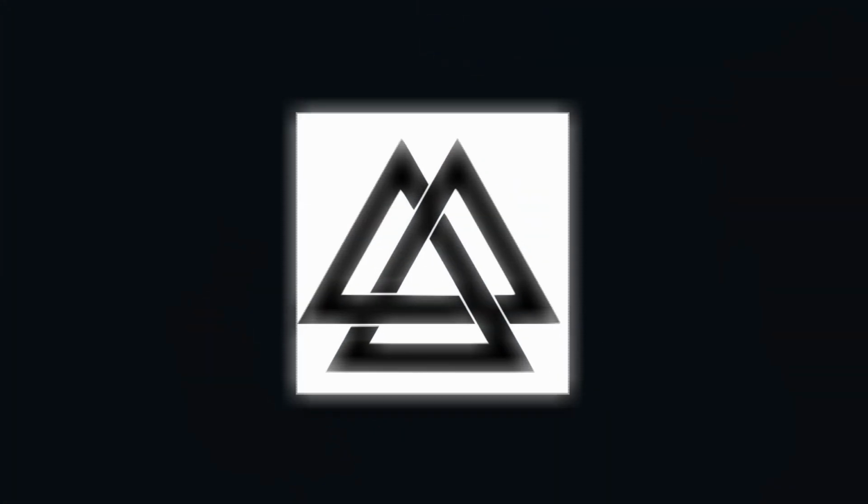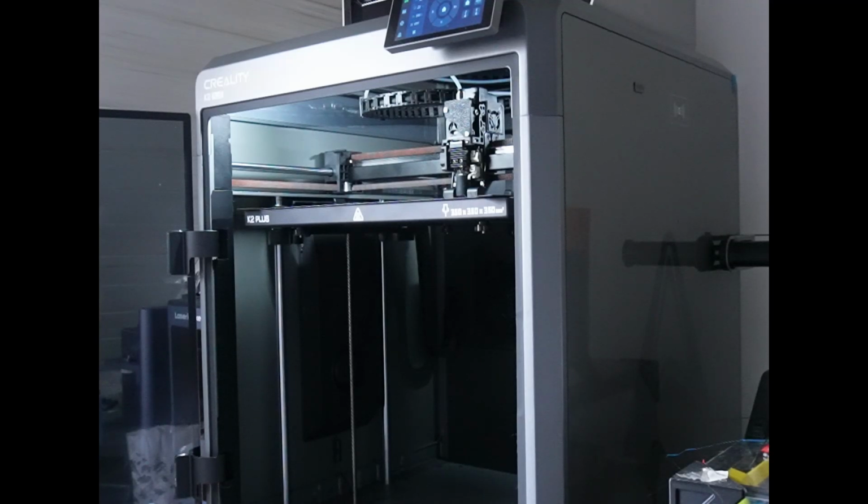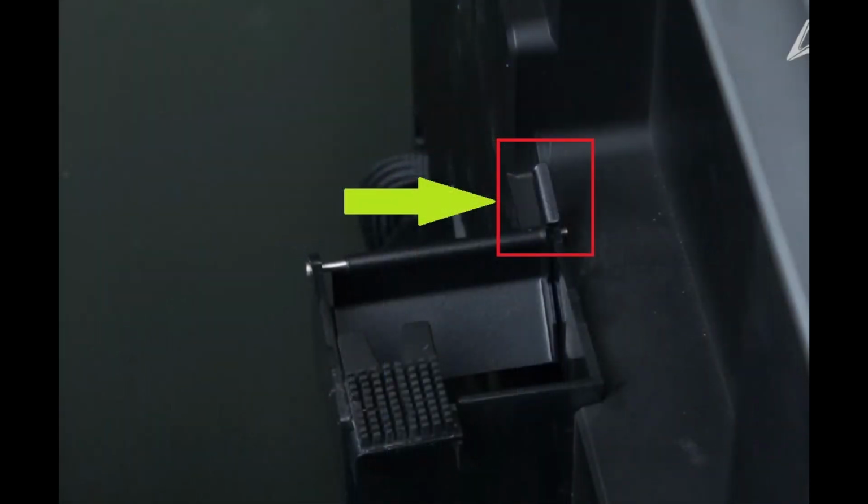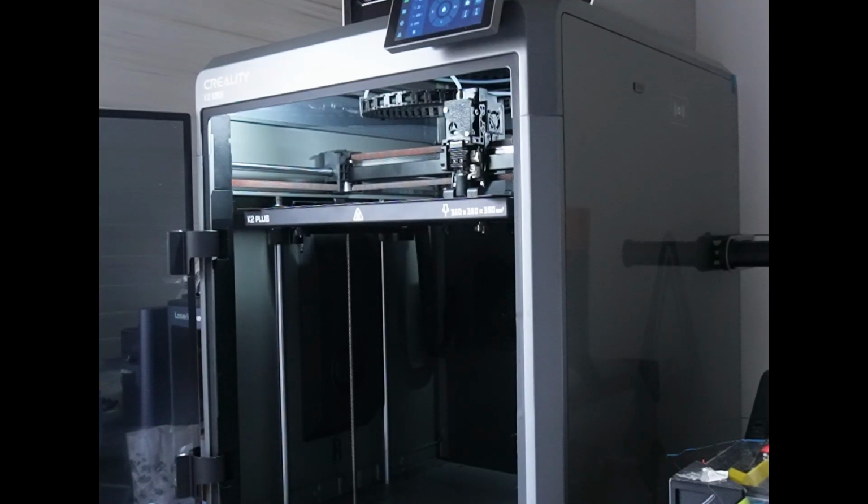First of all, the poop chute problem we had on the last video is now resolved. The issue was that the metal bar where the tool head is pushing against was bent. It all happened because there was a poop chute pile-up clog and it started pushing the metal bar to an awkward position. It's very easy to bend this metal bar, so reshaping it to the original state wasn't an issue.